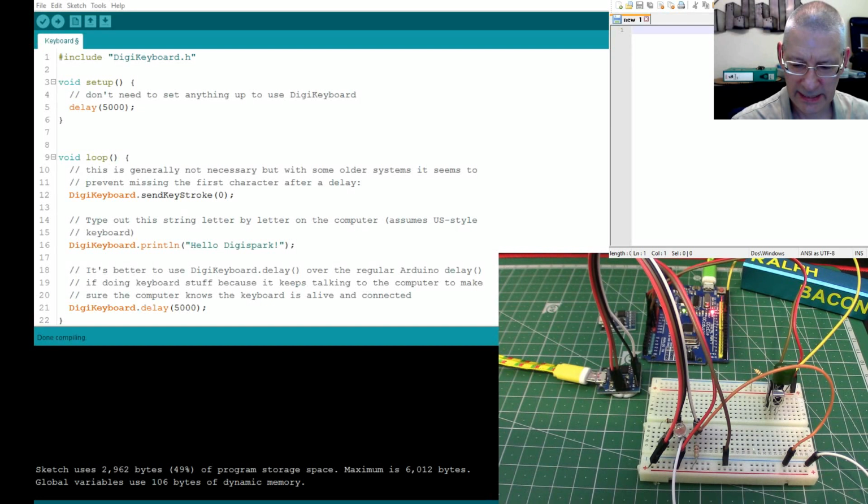what you'll hear is a sort of kadunk, the old Windows USB sound, but nothing appears in the USB list that I can see, or it doesn't appear quick enough maybe. Because the way you program is that first of all you compile this and it will wait. Watch this space down here where the arrow is now, okay? Because what it will say is, okay, I've compiled, I'm waiting now to find a Digispark 85 or an ATtiny85. Plug it in, you've got 60 seconds.